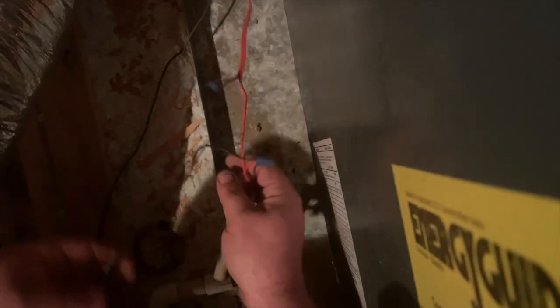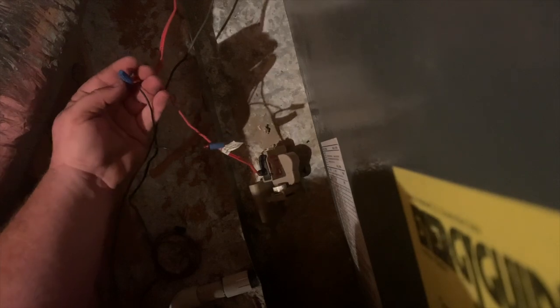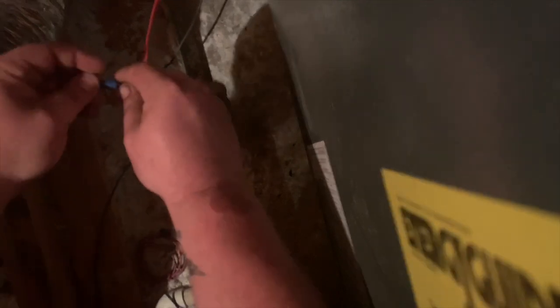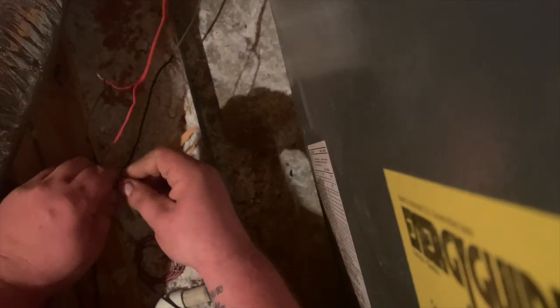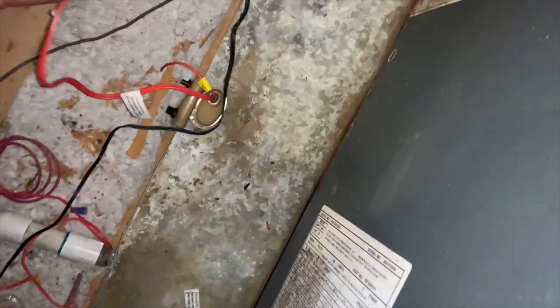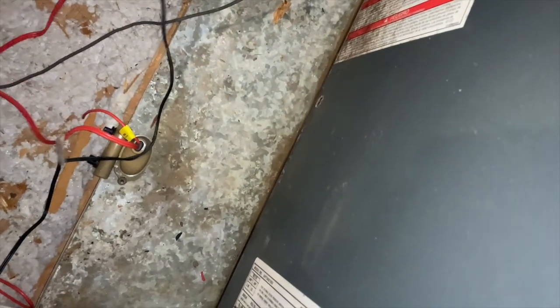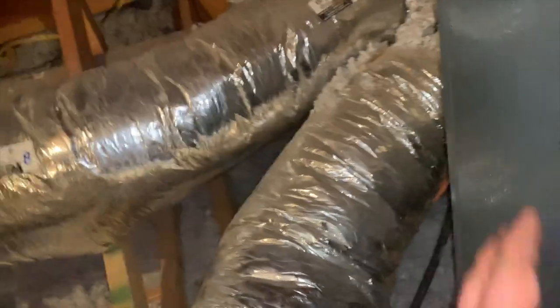They already have wire nuts. Okay, there's an SS1 here. It looks like they have them tied in series, because when this one gets stuck it shuts the system down without the SS1 shutting down. Okay, so we have it wired just the same as the other one — new float switch. I just tied into the one that goes into the air handler, then I broke this one right there, same way they had it. We'll turn the system back on.